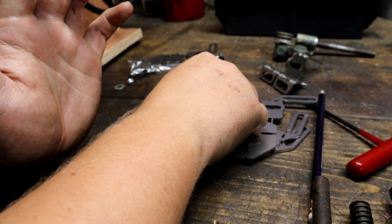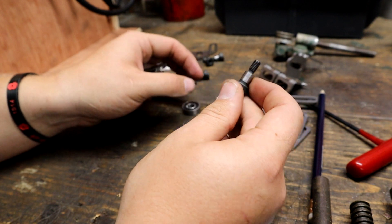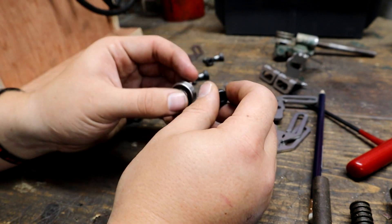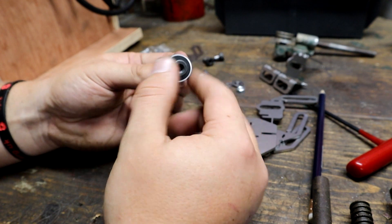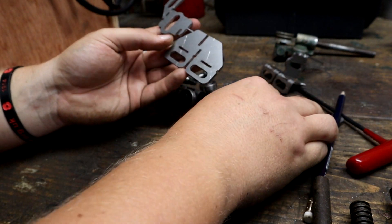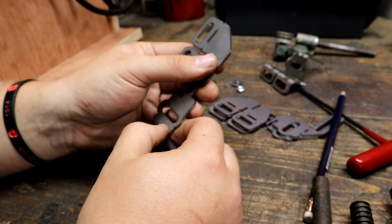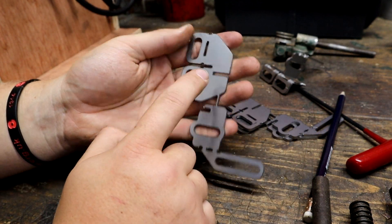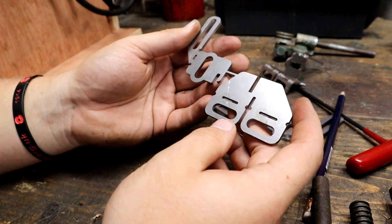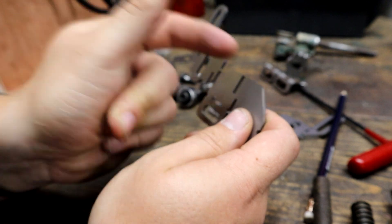You've got plenty of adjustment here on the sides. I cocked up a few times with the length of the shoulder bolt, so I ended up ordering some smaller ones. Think about the bearing, think about the material thickness, and be able to clamp this up without too many washers because washers look ugly. These are the final components — increased slot adjustment for the back. We're going to deburr all these up and put some MIG welds down either side. I'm going to do this off camera because you're not here to watch me weld badly.